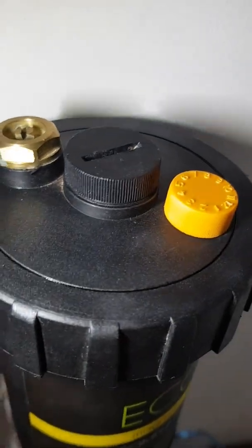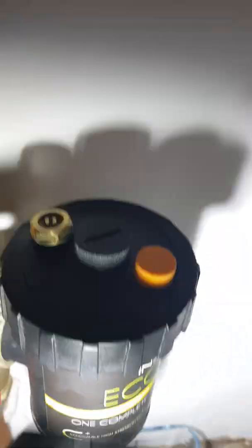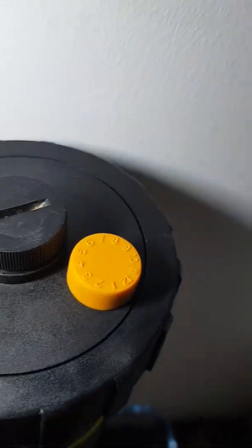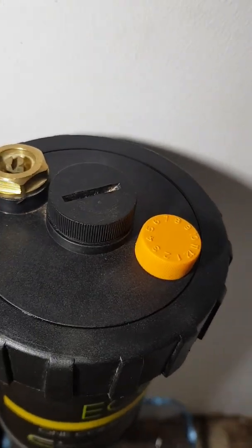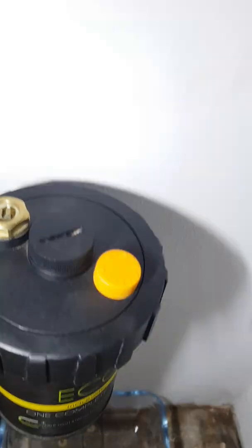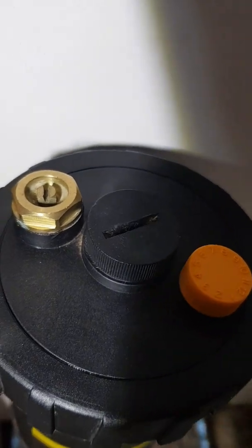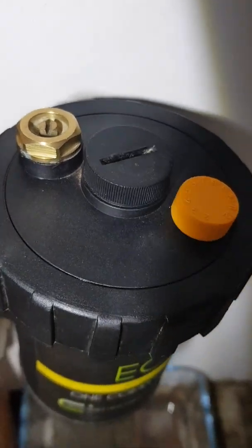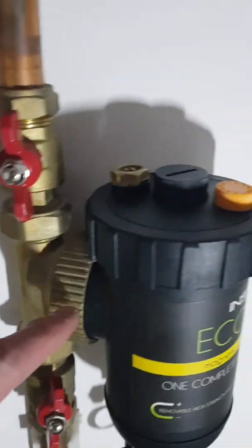It's not leaking now because I've changed an o-ring on the top. The o-ring is squished in there. The orange bit is nothing — it's just a time and date marker to remind you when to change the magnet filter or clean it. The plastic orange thing does nothing. That's a bleed screw, and that is the magnetic core. You can pull it out when you want to drop all the dirt and grime off into a sink when you unscrew and remove the whole unit.